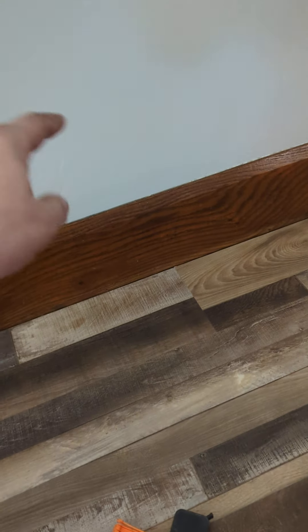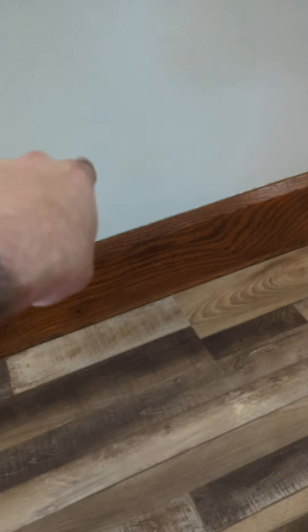If you want a nice seamless floor, obviously the baseboards are going to stay — it's too risky to pull these up. They'll break and there are plaster walls here, so it's going to be a nightmare wall repair. Just pull the shoe molding up. If you're in a house that doesn't have shoe molding, leave about an eighth-inch gap and don't keep it tight against the wall. Don't use quarter round — it looks cheap and bulky. Use shoe molding. Quarter round is literally just a quarter of a circle, but shoe molding comes over and drops down really fast. It's low profile and a great way to cover that gap.